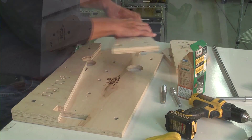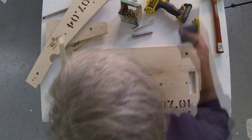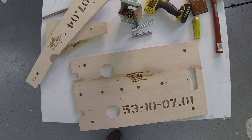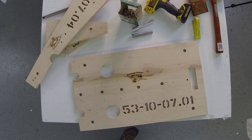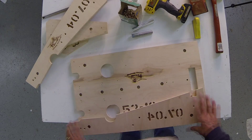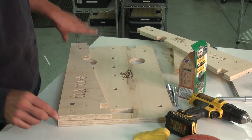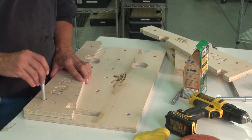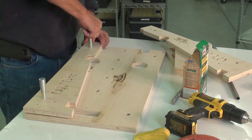We've got five pieces here that we're going to be working with. The base is going to be the start of our part. If you've got any contamination or if you've got wood that sticks out, you should go ahead and clean that off. The next step is simply to assemble these fixtures onto the side. They're designed and cut for a perfect fit, and we've made this even easier by including alignment holes — you can stick a half-inch bolt into each one of the alignment holes on each part.